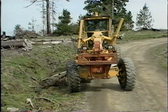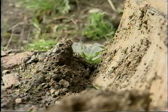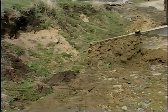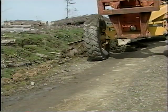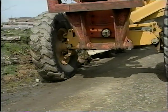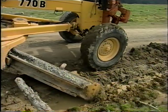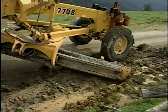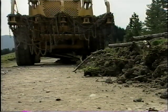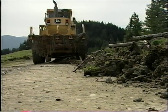As you work, avoid blading aggregate surfacing into the ditch. It's also important not to disturb the cut slope — undercutting the toe of the slope will result in future slope failure. The pulled material should roll smoothly off the moldboard and away from the flow line, forming a windrow on the shoulder of the road. As the berm forms, move the material onto the shoulder of the road. If necessary, perform additional passes with the grader. Avoid spreading ditch waste onto aggregate surfaced roads. On native surfaced roads, accumulated ditch material can sometimes be used as surfacing.